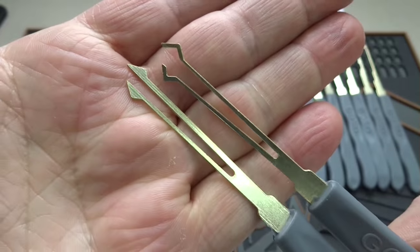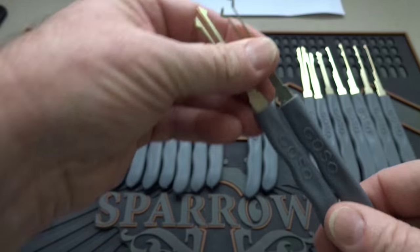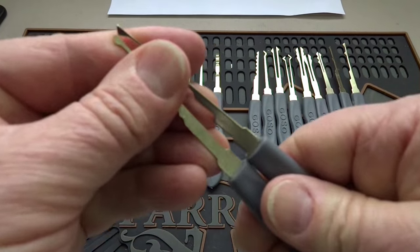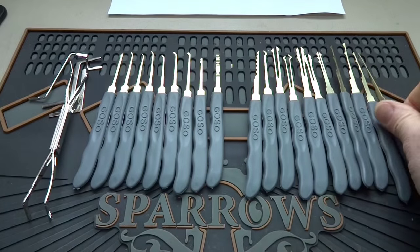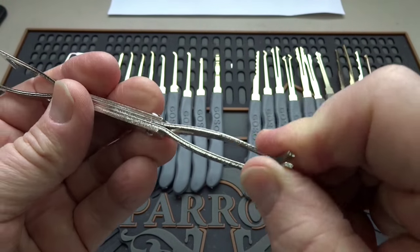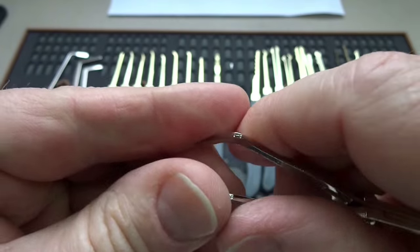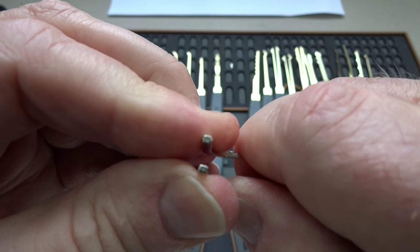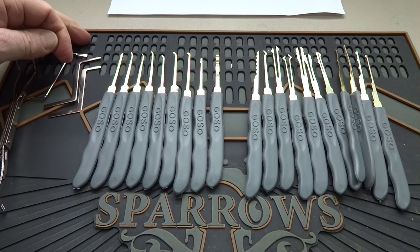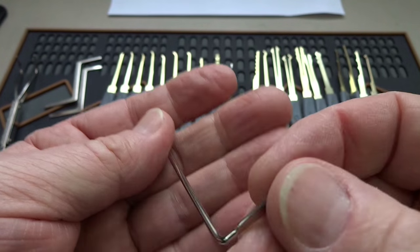You get a variety of other things; I'm not even sure these have names. Some of them are quite similar — for example, one is the same pick, just one has solid tips and the other's got it filed out on the other side. These are double rakes; I can't imagine these would fit in any of the cars in my driveway. On the other side, you have a variety of different rakes. In terms of tension tools, you get something for shutter locks — it's spring loaded with very strong tension; you have to really squeeze it. It's very wide on both ends and so thick it'll use up most of the area you need to work in. You get two Z wrenches — they're identical, one just slightly longer. Then there's this tension wrench, which actually would work.